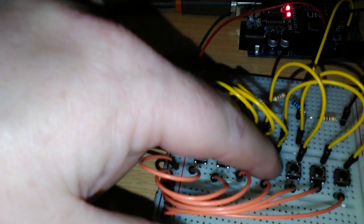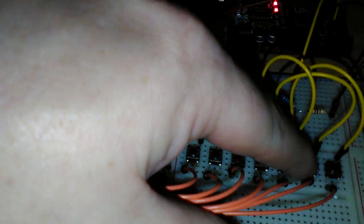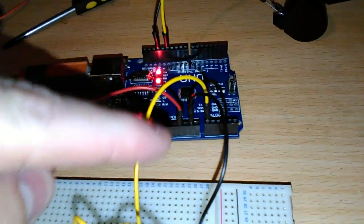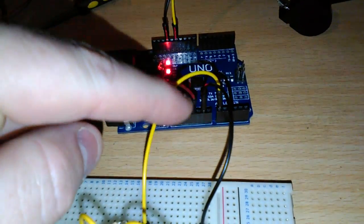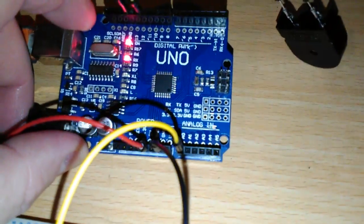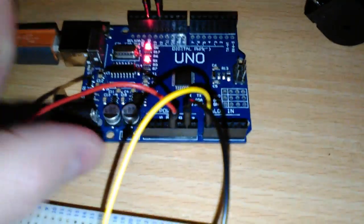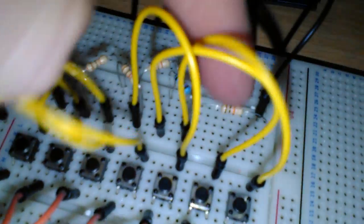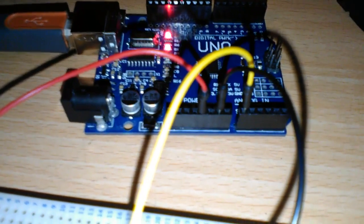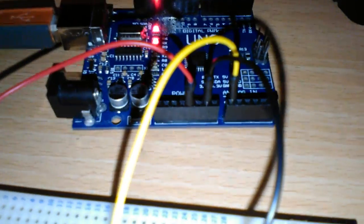They all do different tones, each one. And I'm actually doing this down one data wire — an analogue input, I should say. So as you see, I've got that plugged in through that yellow wire. I've got the other side of the pull-down resistor plugged to ground, as I've done in my previous videos to do with input pins.